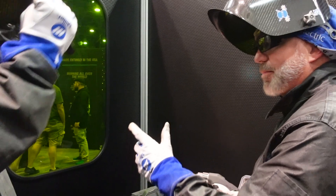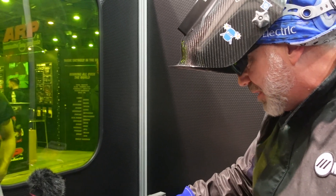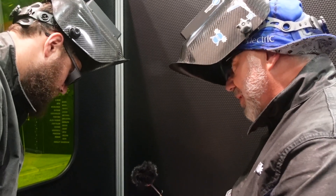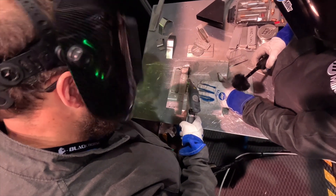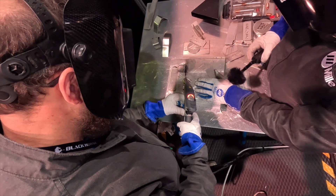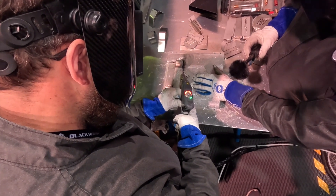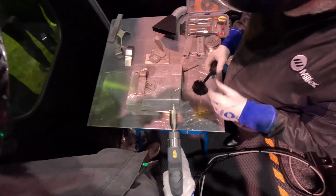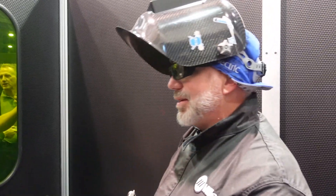Do you want to see the cleaning? Yeah, let's see it. Typically they're going to want to either pickle and passivate or wire brush that down — we've got some coloration and a little bit of sootiness. Same process: pull trigger one, keep the tip parallel with the workpiece at about 45 degrees, then trigger two, and just pull along. Reset your first trigger. Did I do it? Yeah. It doesn't look like you're doing anything, but you get done and you've stripped off all the coloration.